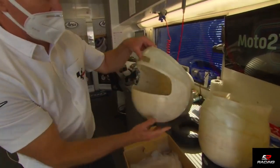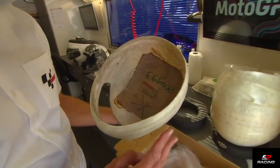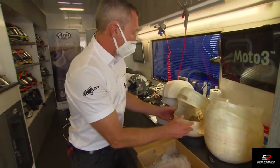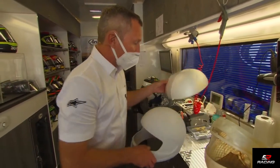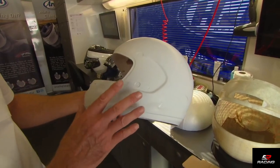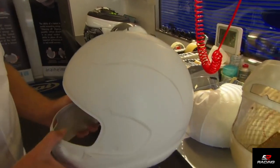The laser's already done its work. Then the person who made this helmet signs in here, and two other people check the quality of the helmet — thickness and weight — to make sure it's perfect, and then sign off on that. The next part is that same shell painted. It's got some primer on it, ready to paint up. Then the shell has top coats and whatever design, transfers, and beautiful lacquer over the top.